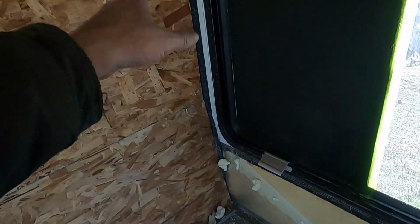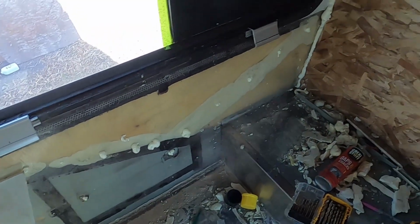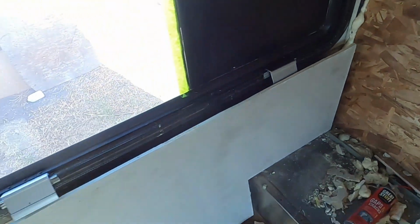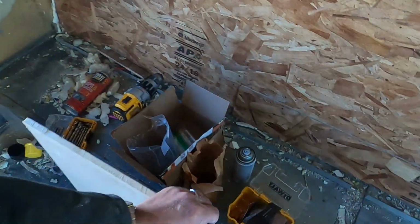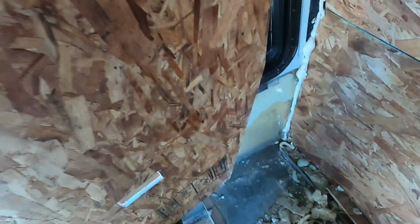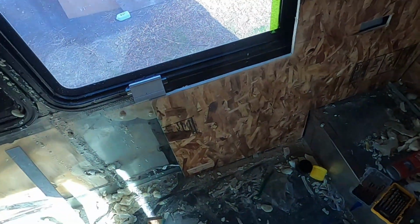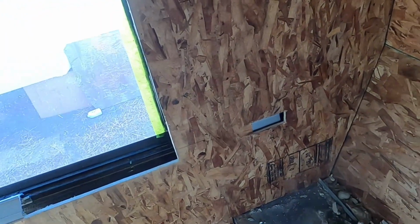So I've spray foamed some of these cavities in the wall, places like these hollow spots in between where the foam is grooved out. Anyway, I've got that, and I'm putting this half inch foam up here over the steel, and then I've got a piece of half inch foam here also that'll go over the whole thing, and then this piece here will actually go over that. So basically the way this will look, of course that foam will go there. That way that half inch foam will cover all of the framework, so that the framework won't condensate on me. I admit this is getting just a little bit weird, but it's the method I chose.